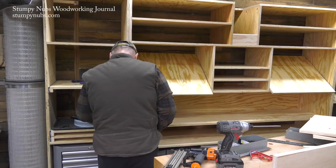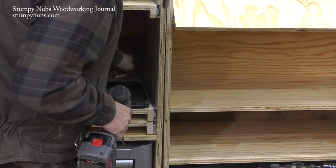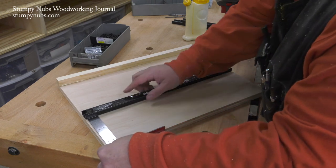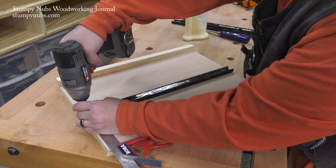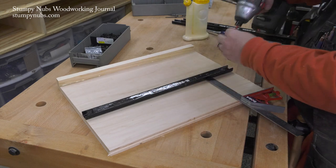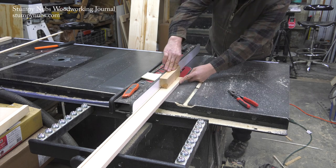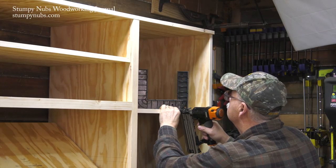And look who decided to show up at the first mention of cold ones. The mustache has a way of slipping into the shop just when the hardest part of the job is finished — he doesn't know which cold one has the pee in it either. Meanwhile, I have some innovating to do. These are chisel trays, and yes, that's a magnetic strip. Some people say you shouldn't put chisels on magnetic strips because it will magnetize them and metal shavings will stick to them when you sharpen. I think that sounds like one of those chat room theories thought up by people who do their woodworking at their keyboards instead of trying it out in the real world. I'm going to try it and see what happens and maybe report back later. I didn't edge-band the miter saw workstation, but that was the nicer seven-layer plywood — this five-layer stuff is full of voids and I need to cover my shame with thin strips of pine.